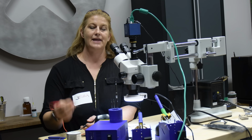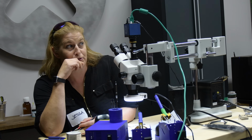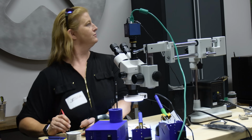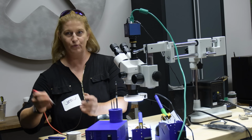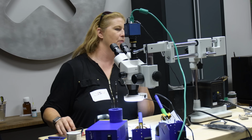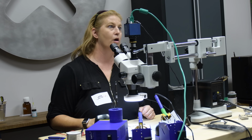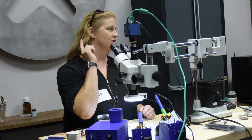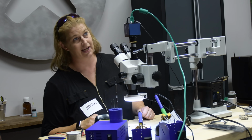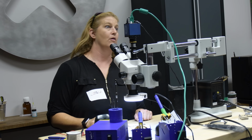And so that is how we get to the common newbie mistake, because what do people think when they measure low resistance? They think, short to ground. I found a short to ground. It's low resistance to ground. It's a short to ground. That's a problem, I better fix it. And especially if you combine that with the physical appearance of that cap with green, what are you going to do then? You're going to think, I have a short to ground on PP_GPU, and I think it's probably this cap, so I'm going to take it off.